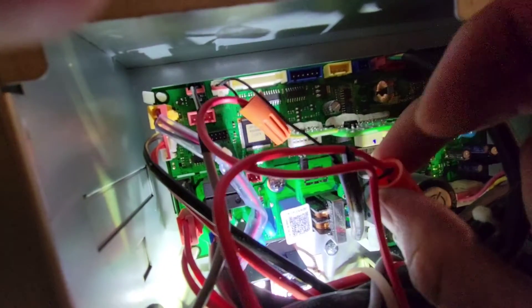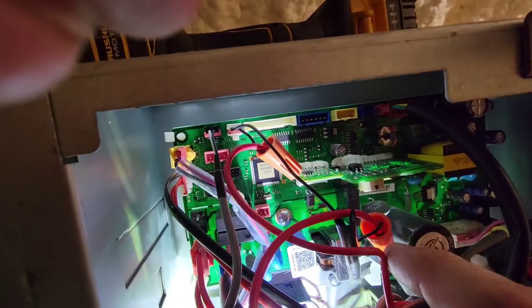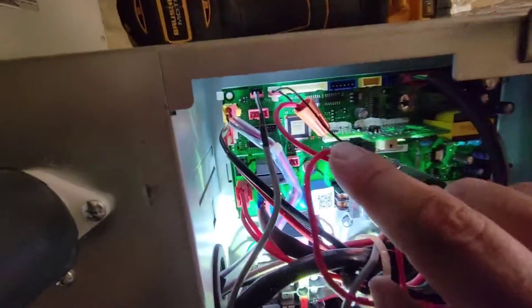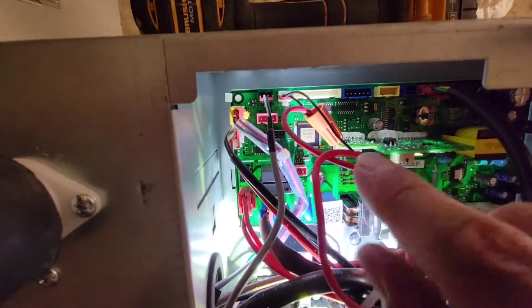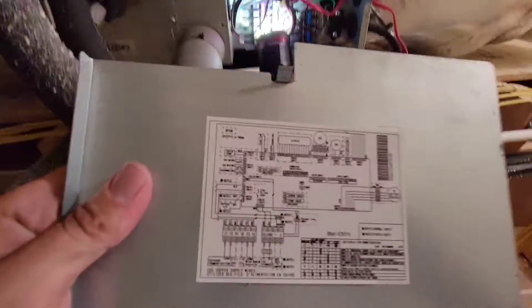You can see how one of the wires has been cut, and I basically wired the float switch in series. So we're breaking this one wire — this other wire is continuous, it's not broken, but the other wire is ran in series with this float switch, and that's how easy it is to install this. I'm going to show you on the schematic where this is. You just pull the plug off, cut it. You don't have to use these wire connectors — you can use a different type of wire connector.